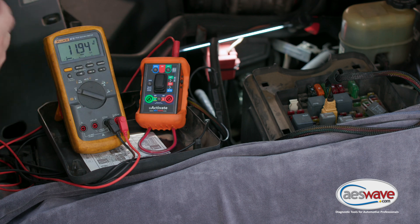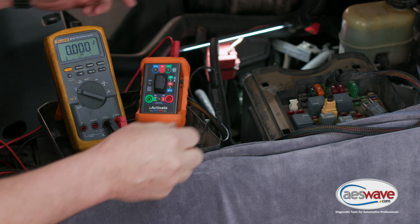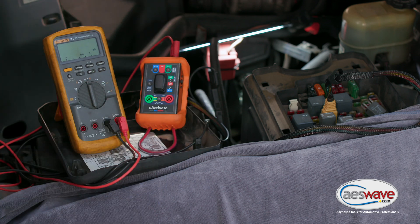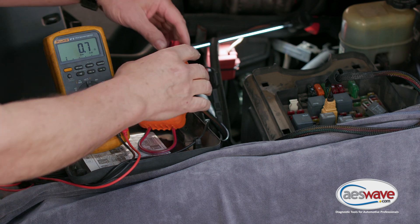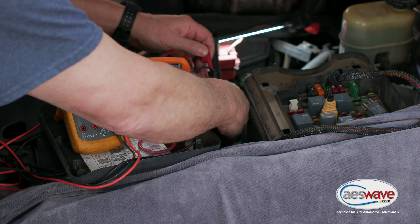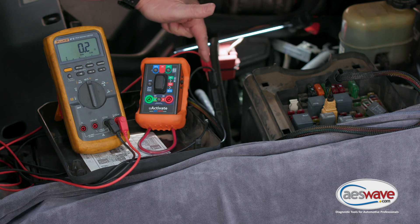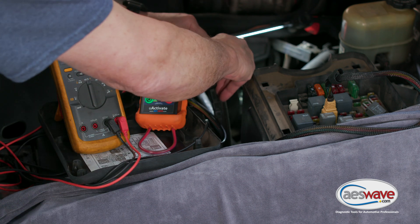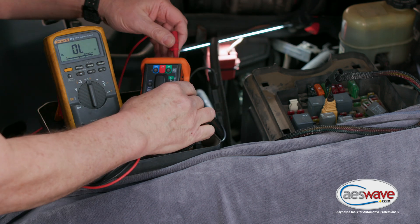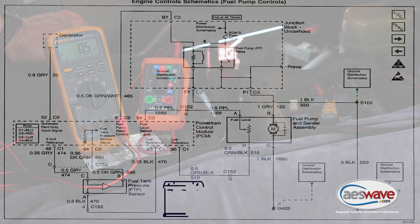To see if we had a discrepancy — now if you did have high resistance in this circuit, we'll go back here. You can see we're at 0.7 ohms. Why is that? Because we haven't accounted for the resistance in our test leads. So we'll go back to negative, zero out here, hit our relative, and then go back and make a measurement.